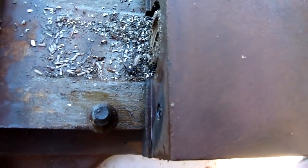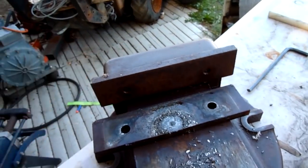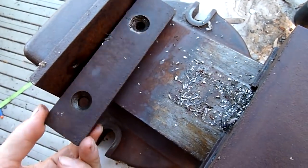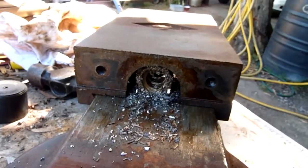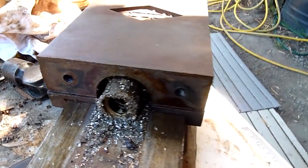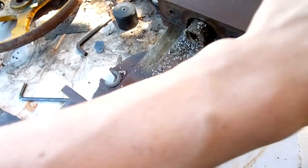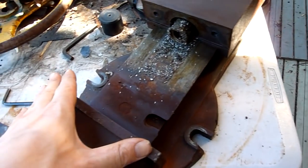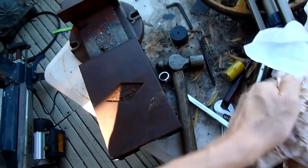There's a fossilized — well, oilified — insect in there; that thing would probably be quite combustible right now. It also looks like someone's replaced these with metric screws — yeah, those aren't imperial. I'm not sure; I can make my own and harden them in the kiln — I can heat treat here. The threads look fairly good, still nice and chunky, not completely worn out. That's the main thing I was worried about — whether it was stripped — but she's still got plenty of life left. It just needs a clean hone and lap of the mating and sliding surfaces. Not bad for a ten dollar vice — that's all I paid, ten bucks. Just got it on the off chance; if it wasn't fixable you don't want to invest too much.